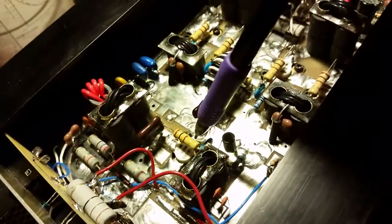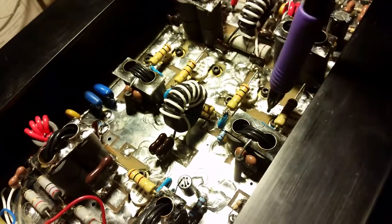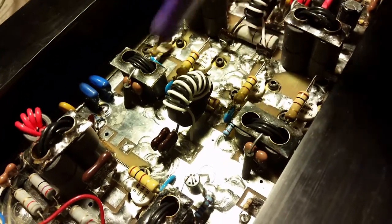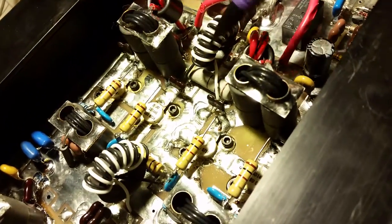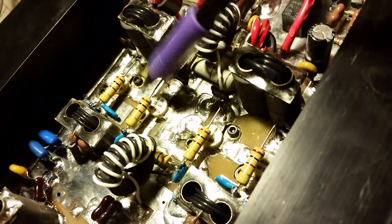I really don't know why, but they never put feedback circuits on these amps — they'll put one on the driver but not on the finals. I always like to throw feedback circuits in because it helps keep your amplifier balanced and helps prevent oscillation, especially when you're overdriving. I also took the two 200-ohm resistors off the input splitter and replaced with a 100-ohm. This is the splitter — it splits to the two pill sections — and this is the combiner which combines them back.